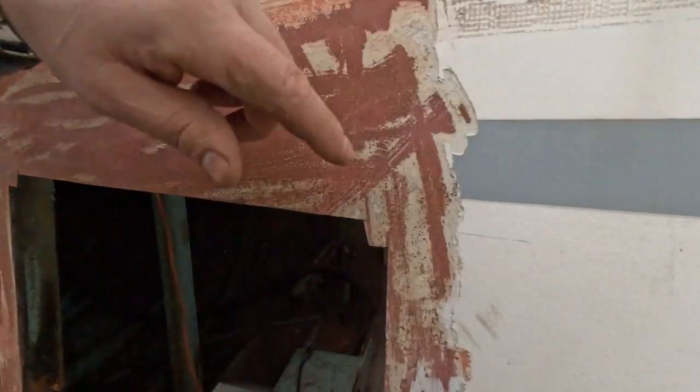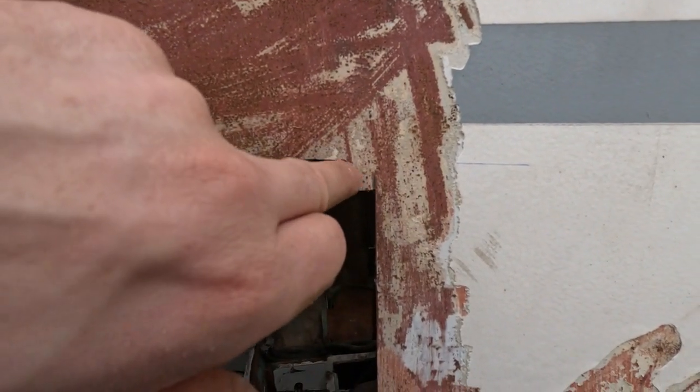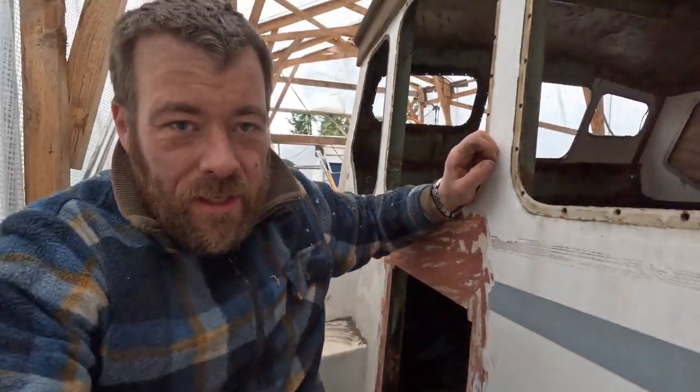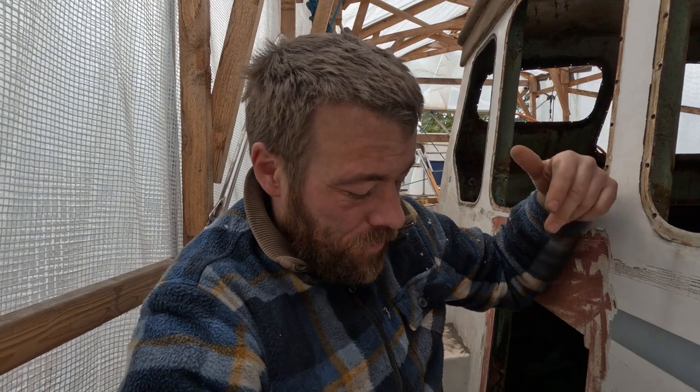So now I cut off the last of the wedge, and then I'm just going to round them with the grinder. Of course, had we done this with the plasma cutter, we could just have cut around, but again, I think it's too cold to bring out the compressor, and honestly, I can't be bothered getting the compressor, the plasma cutter and everything else just to cut out this and then bring it all into the workshop again to cut the plates for this hole. So we did it with the grinder. It was a bit of a job, but it worked.